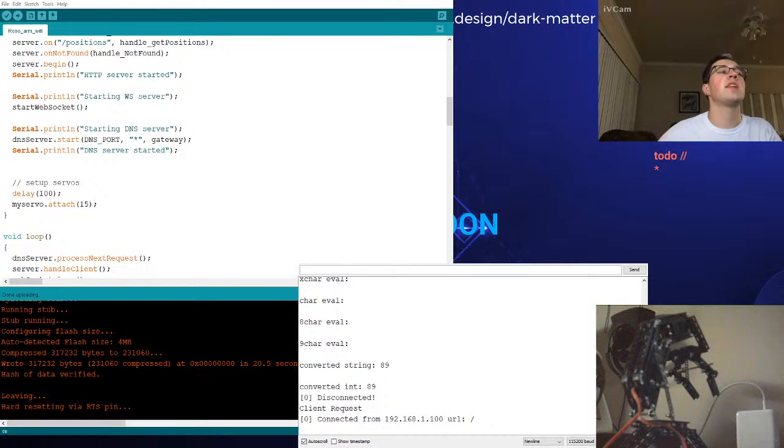So that's the idea behind sending everything as one JSON and then breaking it down and parsing it for each servo. That way, if you hit a home button, you send one JSON object that has all the values. You won't miss anything. That's more difficult, but that's where my mindset was previously.